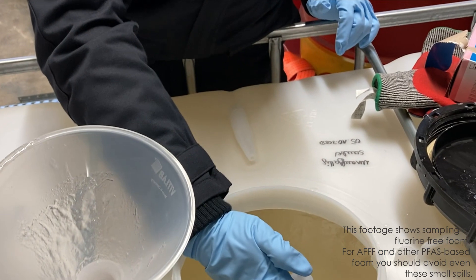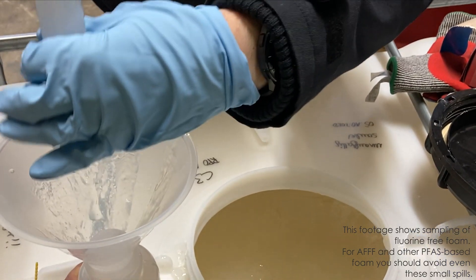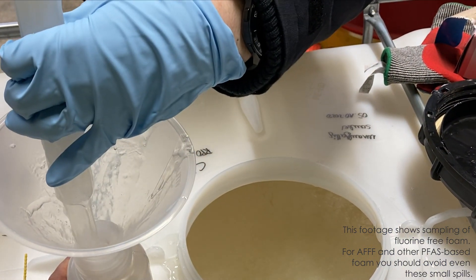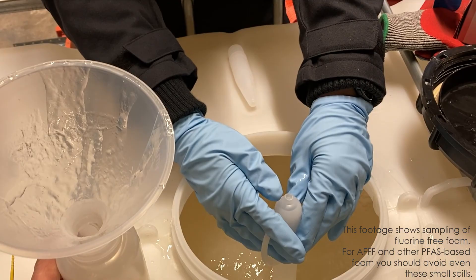Second, from the top: if the tank allows access from the top you can use a disposable pipette to take the sample. Put the pipette into the foam concentrate while pressing your thumb onto the small hole at the top. Bring the tip of the pipette to about the middle of the tank, release your thumb, and wait for a few seconds. Then press your thumb again onto the hole at the top and quickly pull out the pipette. Release the content into the sampling bottle by removing your thumb. The disposable funnel can help to prevent a larger spill. If it is a small mobile container like a pail you could also pour it into the sampling bottle, but if it is small enough to do that it might not be worth taking a sample at all, because the PFAS analysis might be more expensive than the costs for replacing such a small amount of firefighting foam.